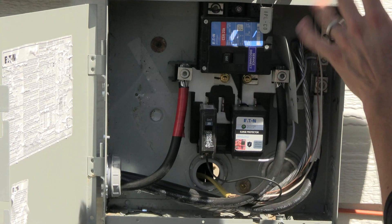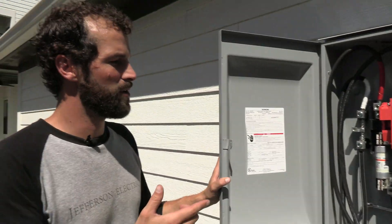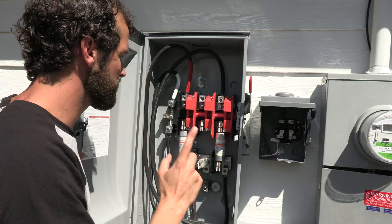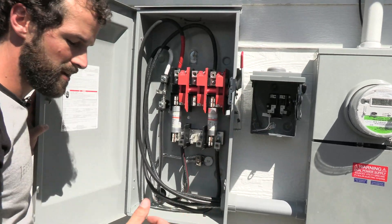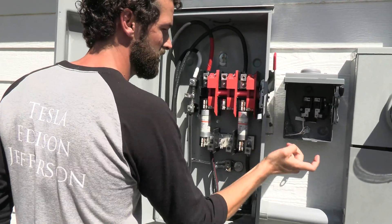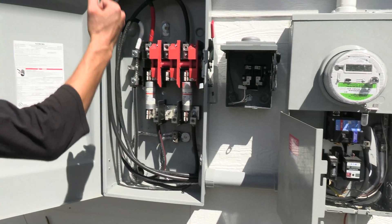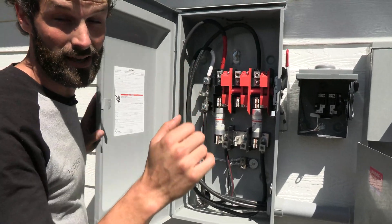We've got a 20 amp circuit which services the garage. From this point, this is our 200 amp lockable throw disconnect. The reason we've got a disconnect there and a disconnect here is because our utility — and most across the state of Indiana — for photovoltaic generation sites, distributed generation, require that lockable throw disconnect, so that if something about the solar generation falls out of compliance, the utility can walk up, throw the handle, and put their lock on it. That's why this is insufficient for their purposes. However, that's still the service disconnect — fused 200 amp disconnect. From here, it pops inside to the Tesla Gateway.